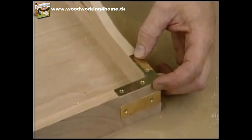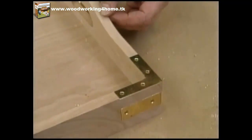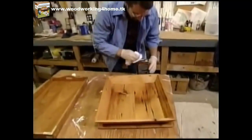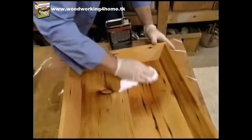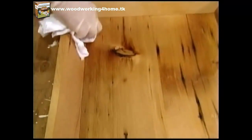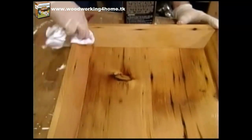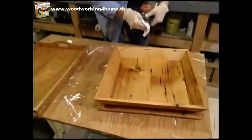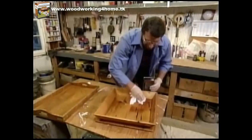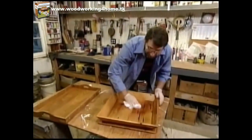That takes care of trimming the top corners flush. I'll just sand the sharp edges off and we're ready for the finishing room. This wipe-on polyurethane gives you the look of a hand-rubbed oil finish yet with the protection of a polyurethane. It's applied like an oil — just put it on a rag and wipe it on. I can get into the corners easily and there are no brush marks. I'll put on a coat, let it dry three or four hours, sand with 220-grit paper, dust it off, and put on another coat. Three coats usually does the job.